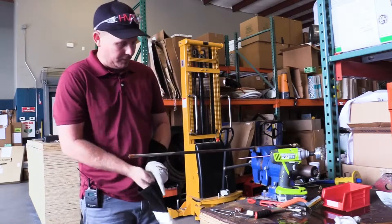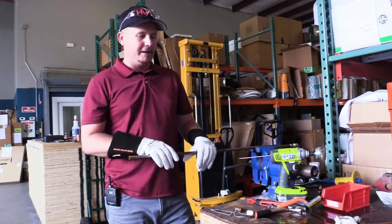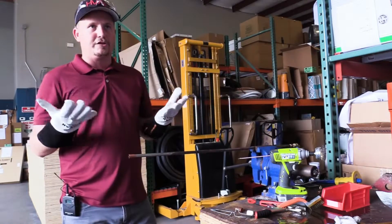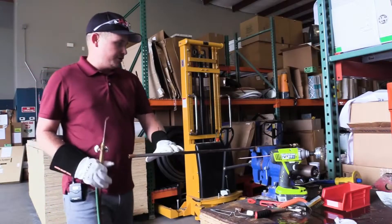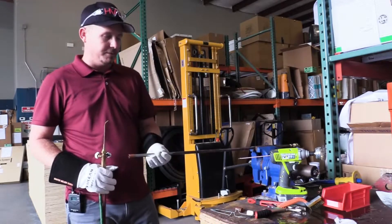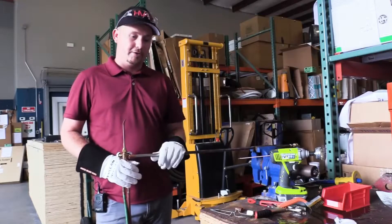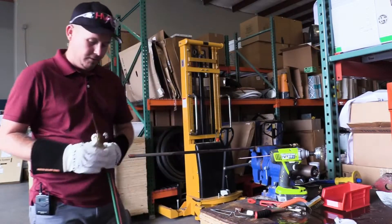I'm going to use a copper coupler on this steel tubing. I could use an air-acetylene torch — I've been using a turbo torch a lot — but I'm going to go ahead and use an oxy-acetylene rig here, which is what most technicians would use. I'm wearing some cartoonish gloves just to emphasize the importance of safety. If I was working up against a compressor, I'd want to use something to trap the heat — a great product is Heat Block by SolderWeld, or Wet Rag by Refrigeration Technology, or just an old-fashioned wet rag.